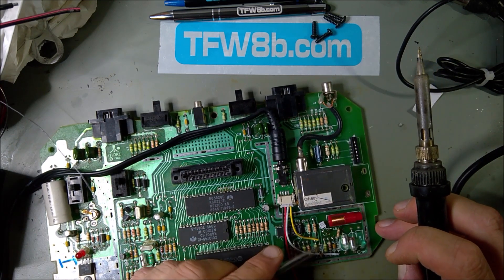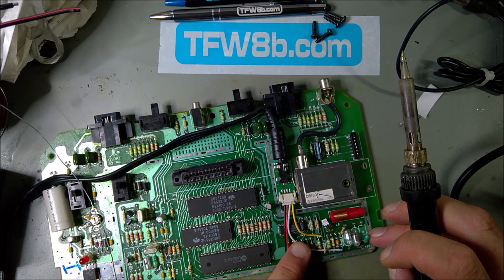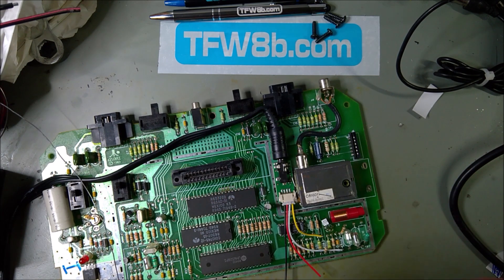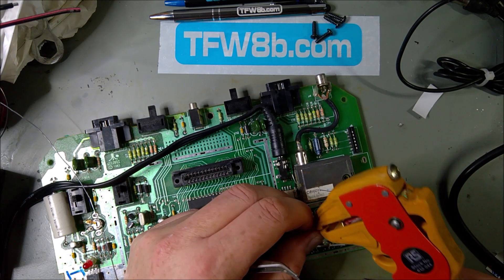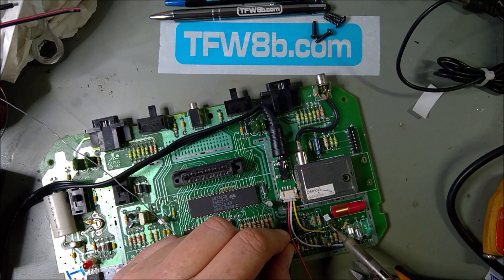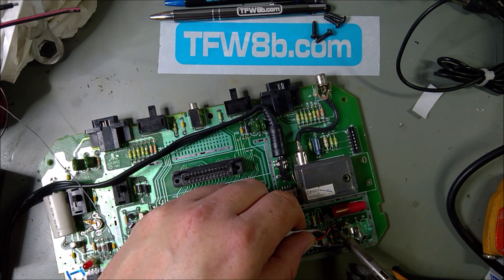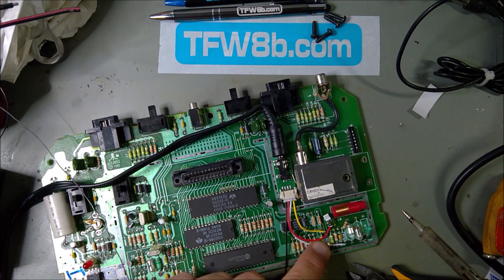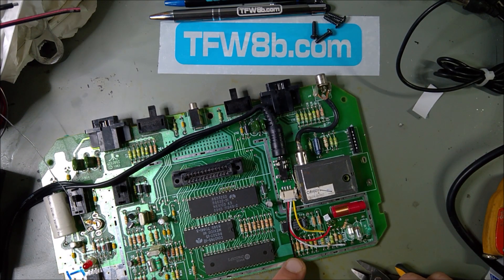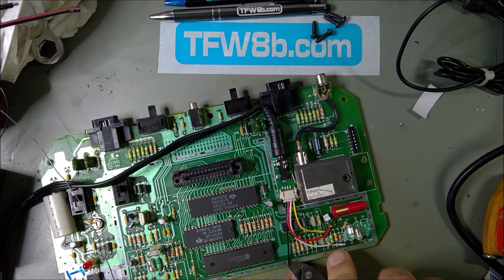So that's disconnected. Transistor's disconnected — let's move that wire there. That's disconnected. That resistor's disconnected. That resistor's disconnected. Now I just need to get some 5 volts from about there. I'm doing this by feel, really. So if this looks terrible, I can barely see it. And a bit of ground — I'm going to take ground to where it's obviously ground, right to the edge of the board here.